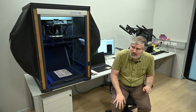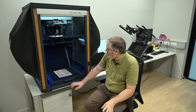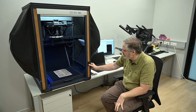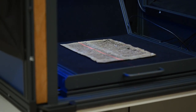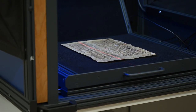And it's, again, a point that I will make in my slides, that computers and cameras see what we have designed them to do, not necessarily what we think they should see. And that comes down to really fundamental things, like if you see here, we have two lasers. And these lasers, when they intersect, show that this is in focus. Because we cannot focus this camera for a couple reasons.